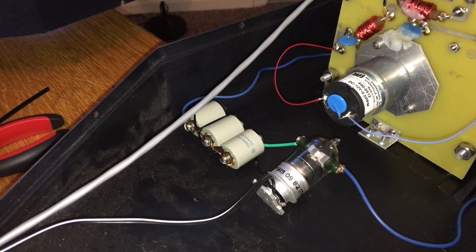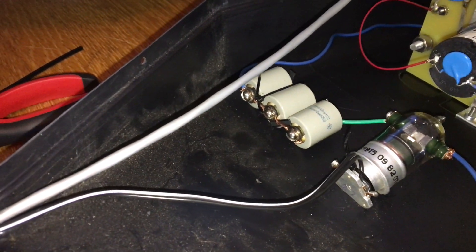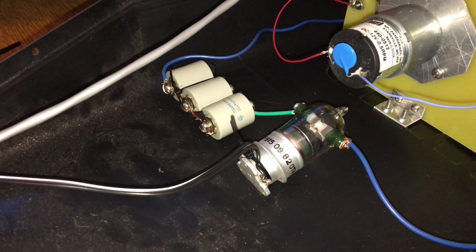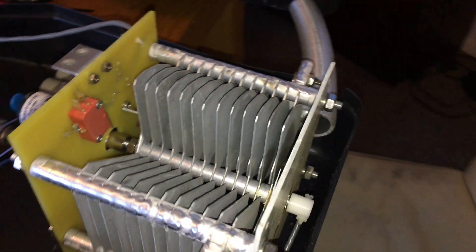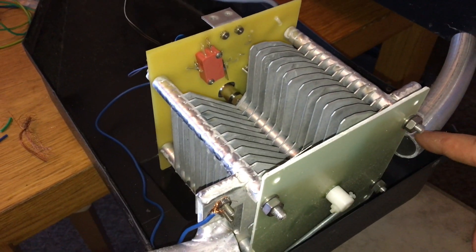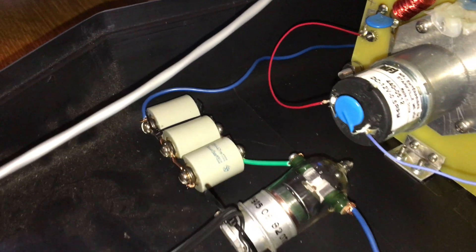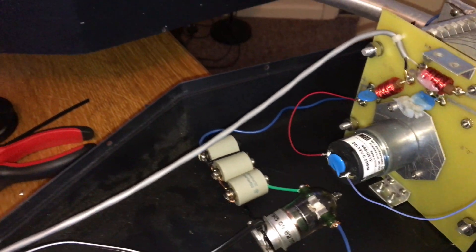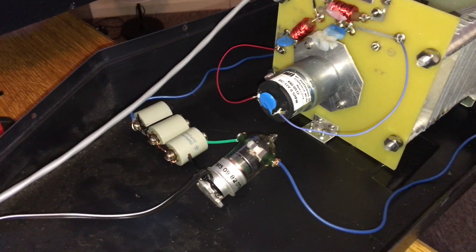The problem is you could use different relays or capacitors, but I tried cheaper things from eBay before and it doesn't work. After testing, I found that there are around 2 kilovolts present at the top of the loop when transmitting, so it's quite high voltage. Because of that, you need to use high-quality, high-voltage-rated components.